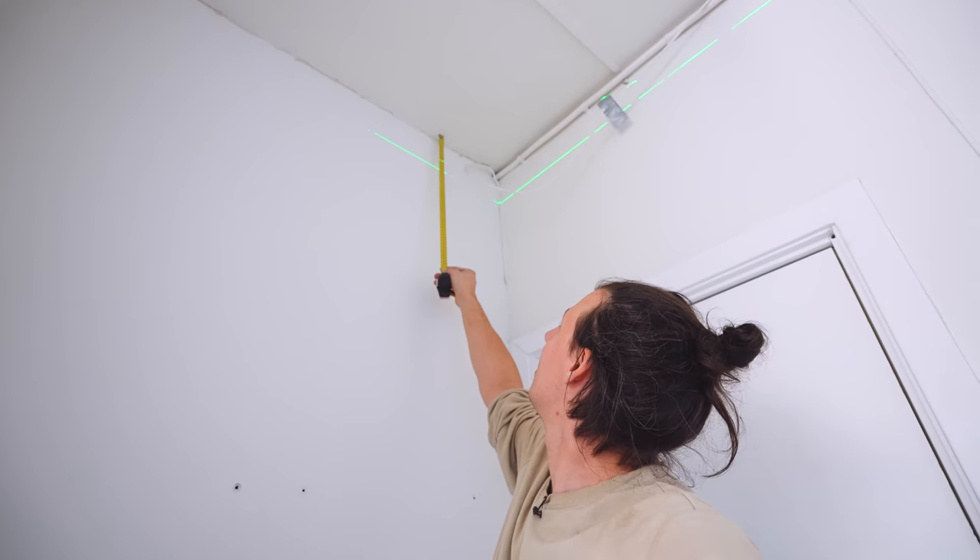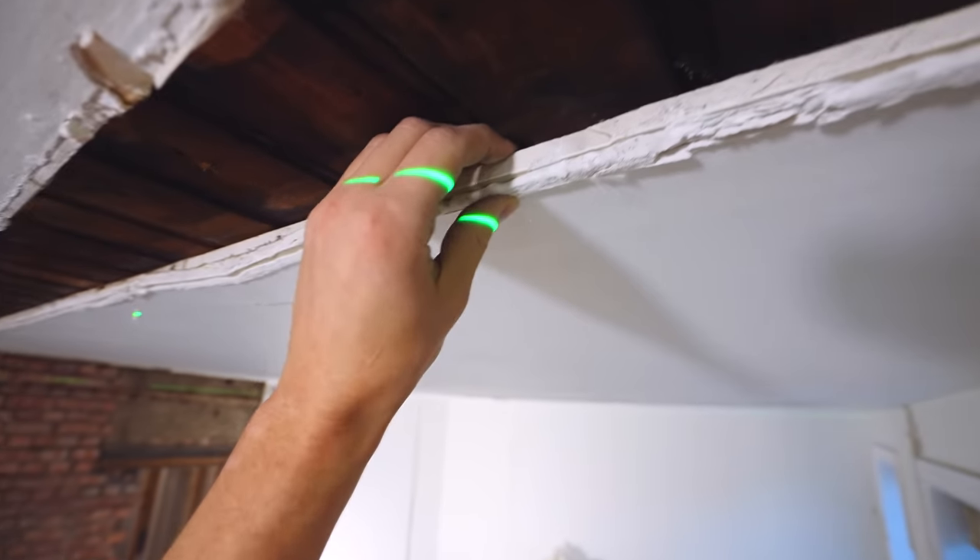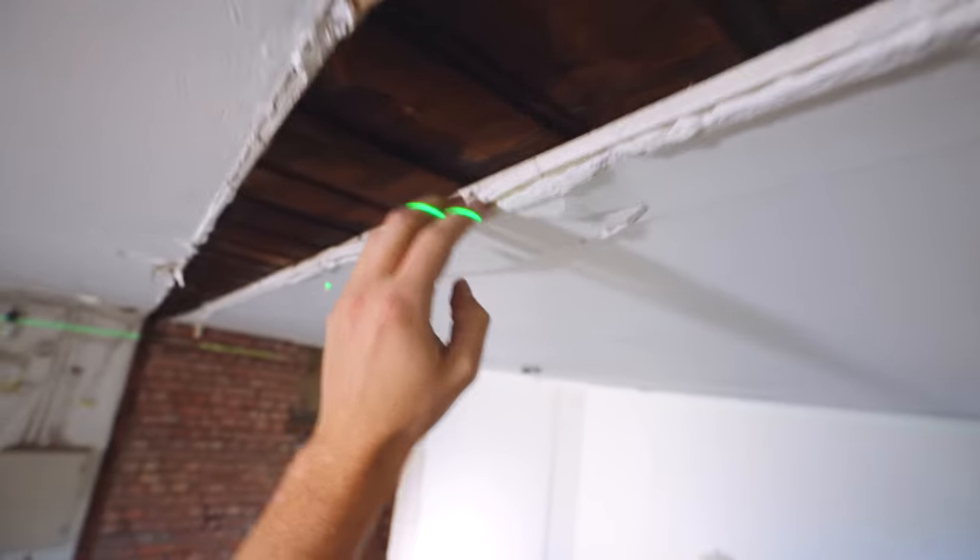About the same goes for the far corner over here with about 14 centimeters height difference. In reality, I have two options. Either I just live with it, slap another layer of plasterboard on the ceiling and call it a day. In addition to the wood paneling, I already have two layers of plasterboard in the ceiling — that would make it three — which I guess wouldn't really be an issue, but it doesn't really help that much. Option two is to just rip everything down: replace all the plasterboard, rip down the wood paneling, make everything perfectly flat, and it would give me an opportunity to put some insulation up in the ceiling as well.